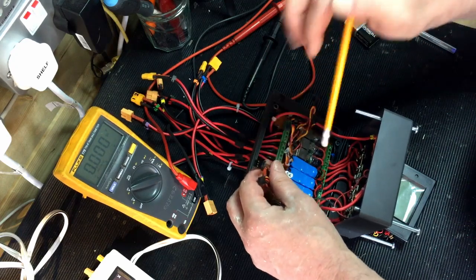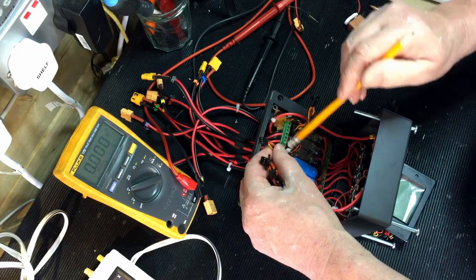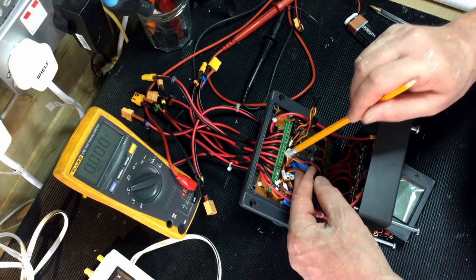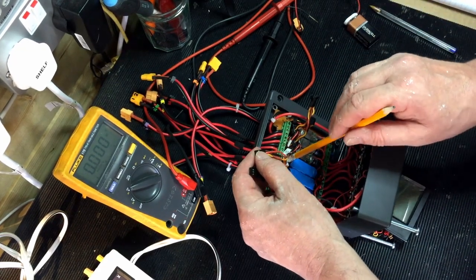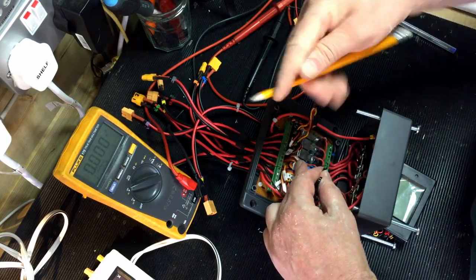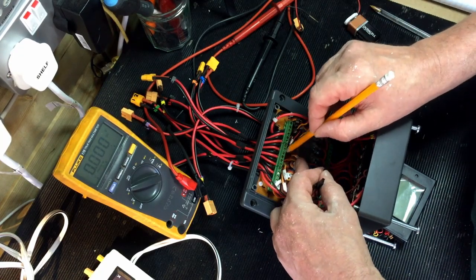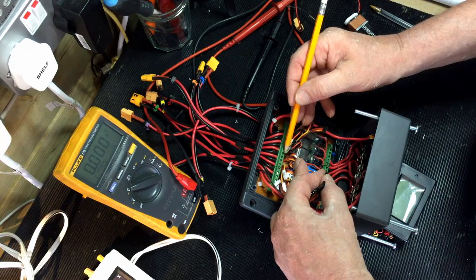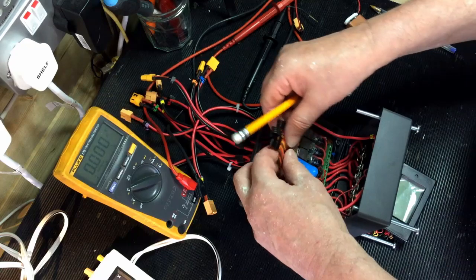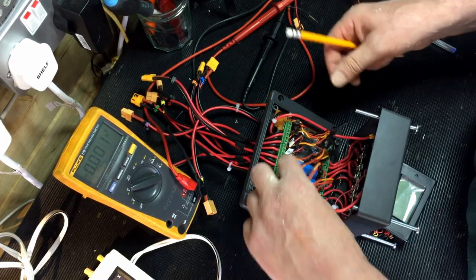So I've wired the main output onto the PCB, and then wired these in parallel onto the PCB, if you see what I mean, and then just taken the volts out. So we've got hot and cold, or the plus volts and ground and signal coming out, and wired onto the PCB inside here, and then these wires cut off and terminated onto those same connections, and the plus and ground volts go to these pins. So we're just taking the voltage out onto those. But these are for future. You can use the programming little module to plug in, and these are just pushed down here just to get them out of the way.